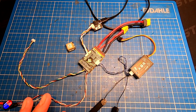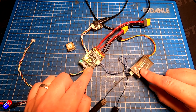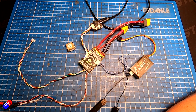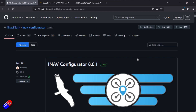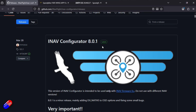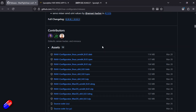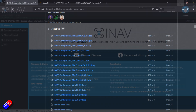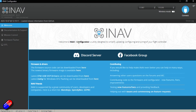I'm just going to plug this into the computer. The cool thing is that if the receiver and GPS were connected they would be powered as well. With that set, we can download the latest version of iNav configurator to flash it to the latest version of iNav. This is the current version as I'm recording this: 8.01. If you zoom all the way down and see all 16 assets you can see we have it for Linux, Mac, and Windows 64/32. I download the Windows 64 stuff as a zip file, unzip it, and then you're ready to run it. With iNav configurator started on your computer, we're ready to actually flash the firmware.